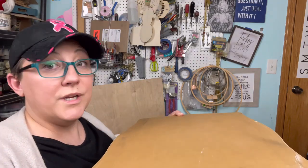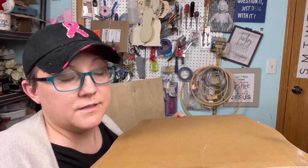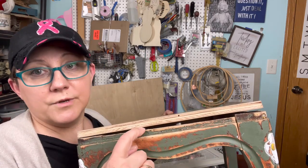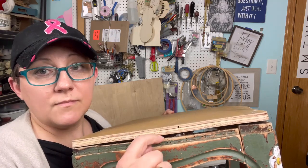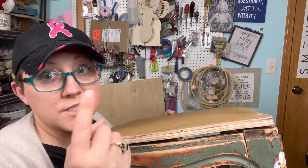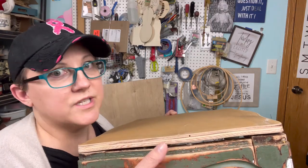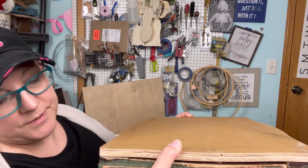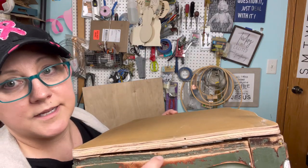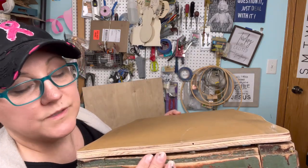What I'm going to do is use figure eight attachment pieces, because there's a little lip here — there's some space between the frame and up here. This is the perfect configuration for the figure eight. They're great for tabletops and perfect for this kind of setup, because we will have a little gap here. I'm going to upholster and staple to the upholstery lip that's on there, so you won't see the gap.